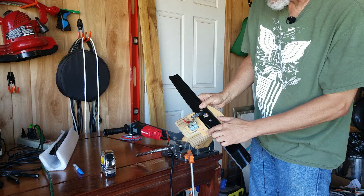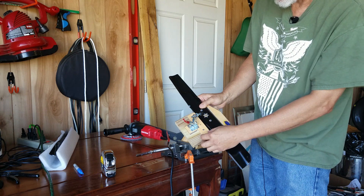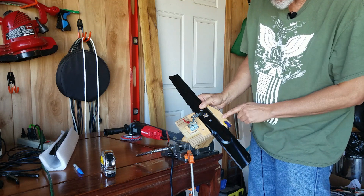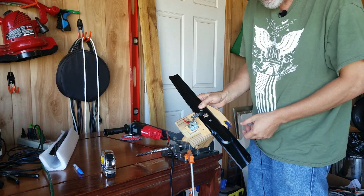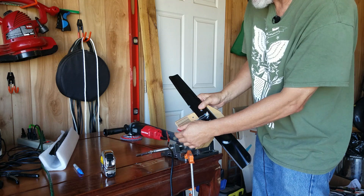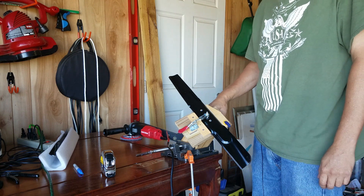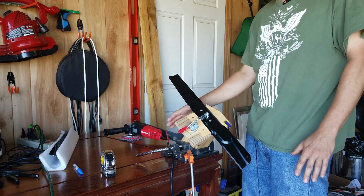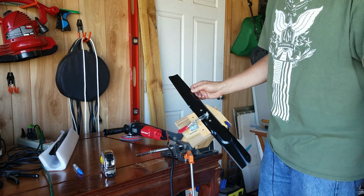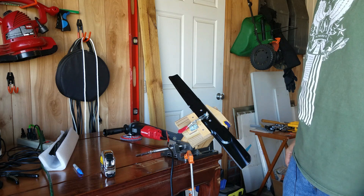Real simple — just a small section of pressed wood here, about a quarter inch. This was three-quarter inch and I shaved it down to approximately a little bigger than a quarter inch. That just locks in there and gives you 32 degrees, because the angle cut on the top of the four-by-four is 32 degrees. I angled the whole four-by-four backwards 40 degrees — leaning it back a little more was just more comfortable. I like this setup; it looks good.